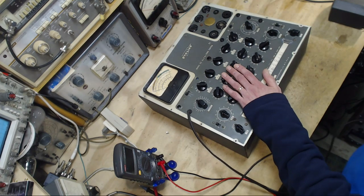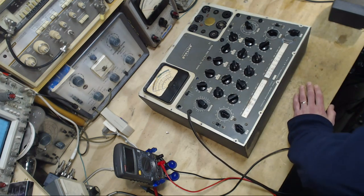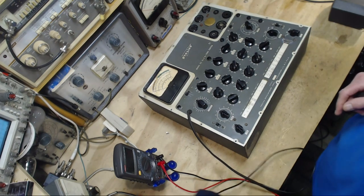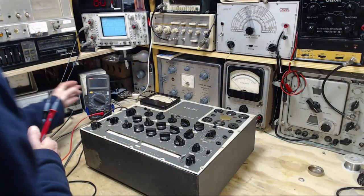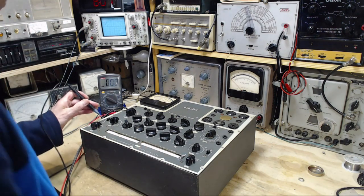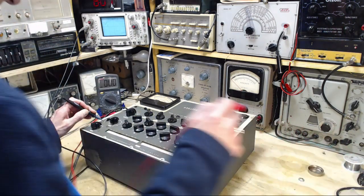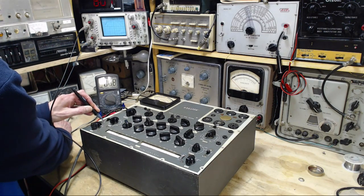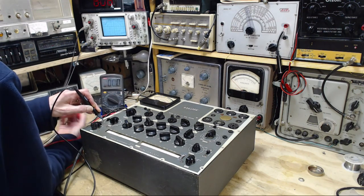So what should we do here? Let's plug this guy in and check him right away. It's just a two-prong plug going right into a regular three-prong type outlet. Now, without turning it on, we're going to hunt around for some voltage here. And we're not going to use me to do it. We're going to use the meter. Okay, chassis to ground. Any one of my pieces of equipment now are grounded. So you see an exciting 6 volts there. I don't think that's what got me.